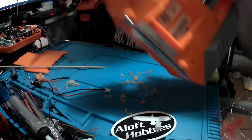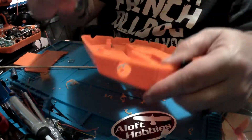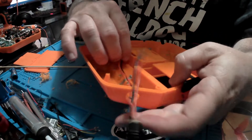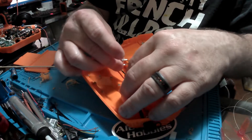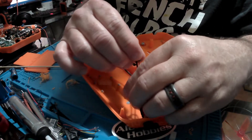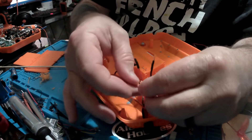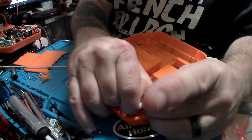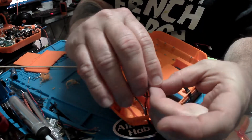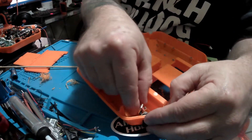Quick and easily, we have a nice, perfect-fitting, beautiful, clean hole to put our assembly through. So we're going to slide everything back through, grab our nut. You can do it either way — long lead first or short lead first. I like to make things hard for myself, so I did the short first. The long lead will pop right in, no problem, with only a slight issue but nothing breaks. Then we put our short leads through with the pins and cinch down the nut.